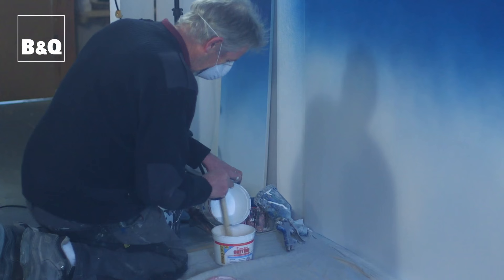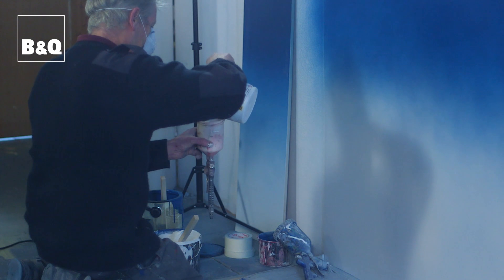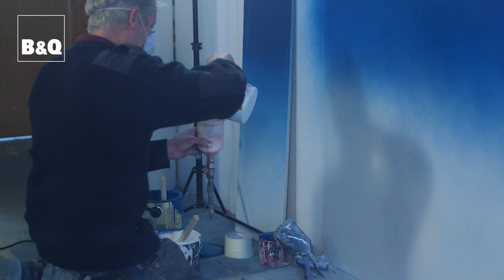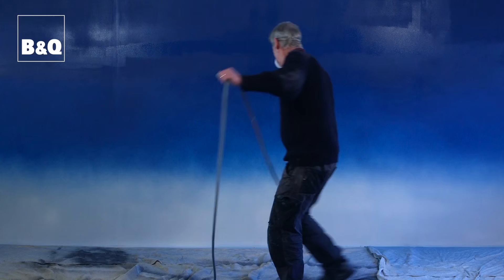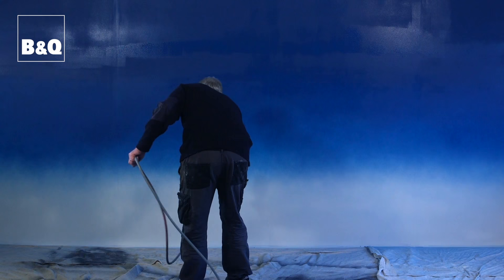Because you're using two colors you can bring the other color back up, and if it's too much you can keep alternating until it's right. Once you're happy with the spray effect that's fine, but the biggest problem is if it gets marked it's very difficult to touch up because you need a spray gun again.